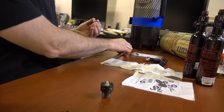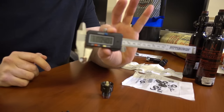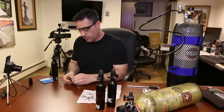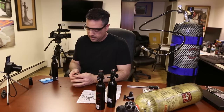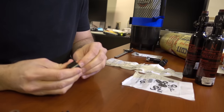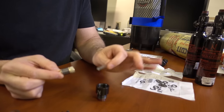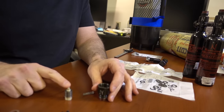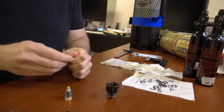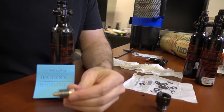You can check the total shim thickness using a caliper — it reads 0.04. There are three shims: 0.02 on the bottom side and two 0.01s. Remove them by wiggling — you'll hear a little pop. So inside you have: a spring, the piston with the Belleville washers, and a ball bearing. This is a good time to clean everything out. Remember: never use oil or silicone grease — no grease, no oil, never. Oil is combustible.